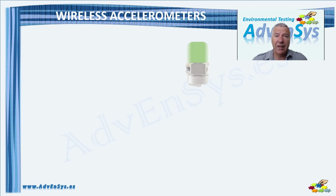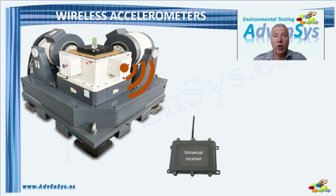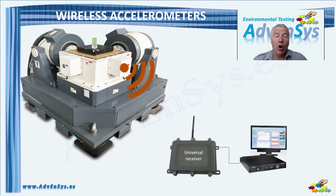A wireless triaxial accelerometer looks similar to the image. It's bigger and heavier than a typical piezoelectric accelerometer, and this can be really challenging for many shaker table applications. However, we can just fix it to the measurement location without any cable, and it will transmit to a receiver that we would connect to our controller's input channels. Although this configuration looks really nice, it has several drawbacks.